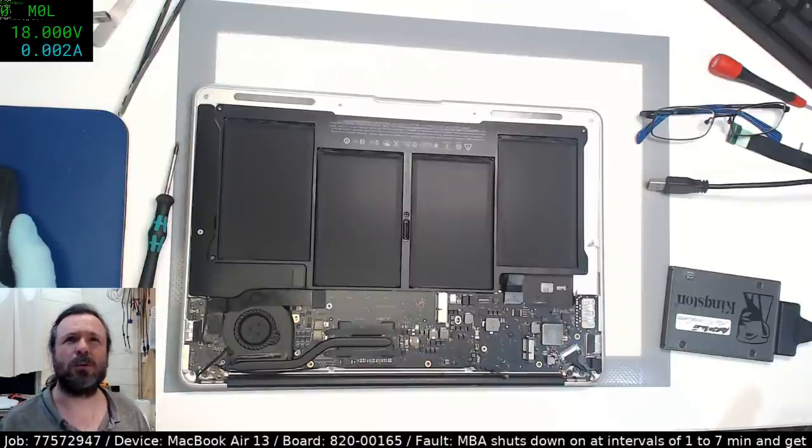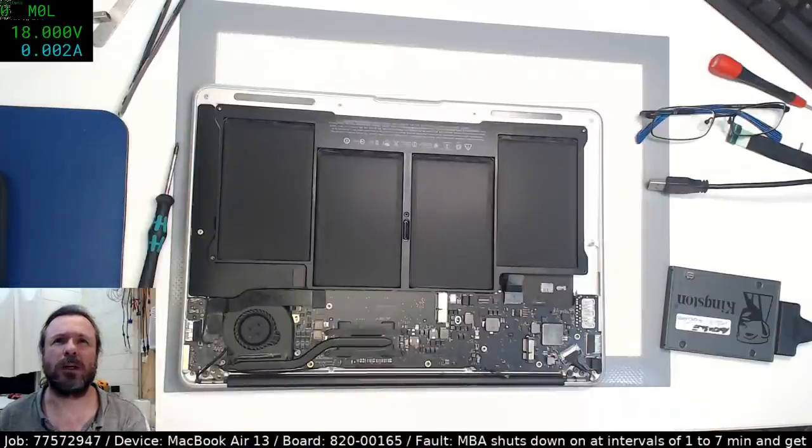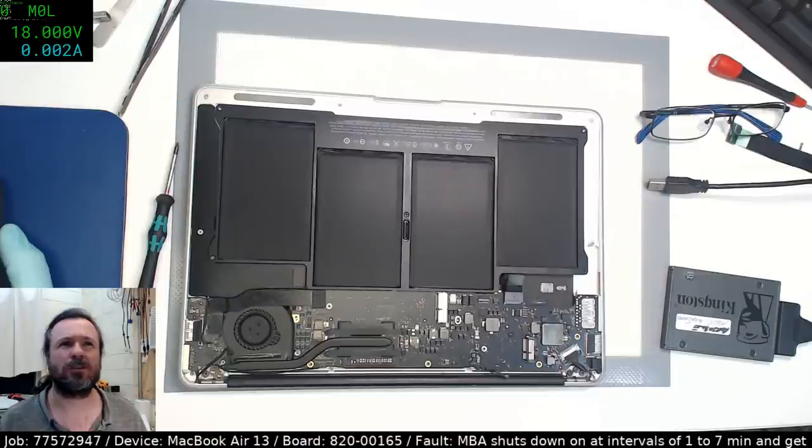Oh, that is the same dip we saw before. Okay, the biggest concern there is definitely PP Bus G3 Hot taking a serious dive. All of it's taking a dive. Current consumption tanks. Which comes first, though? Interesting that one of the temperature rails goes berserk. So G3 Hot takes a dive, and then whatever it is, 12 volt rail, I'm guessing there. CPU is the one that probably takes a dive as well. Yeah.